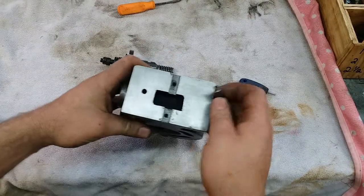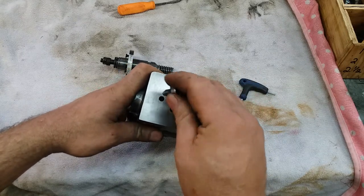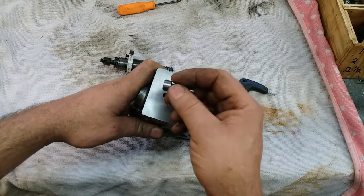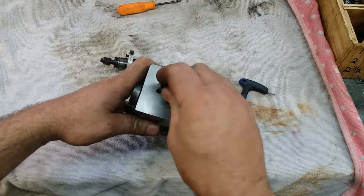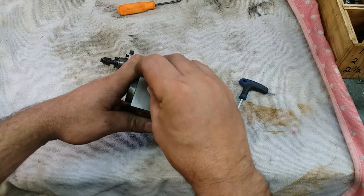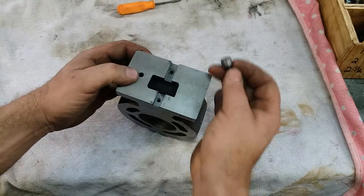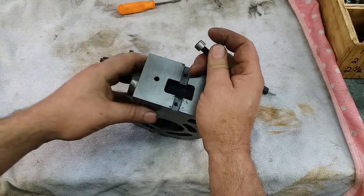So what I aim to do is set this up and drill this hole out for 8 millimeter tap size, which is 17/64ths. Once we get her drilled out, I'll take a half inch end mill in the drill press — which you're not really supposed to do. But a 5/16ths counterbore bit is 0.470 OD and I'd rather use half inch OD. So I'll bore that out with a half inch end mill so we've got a good countersink, and I'll make that countersink so that the top of this bolt is below the face of this rotary table. Let's go set her up in the drill press.